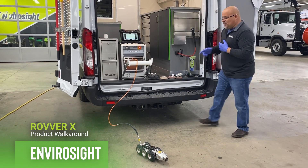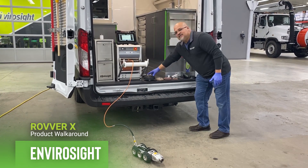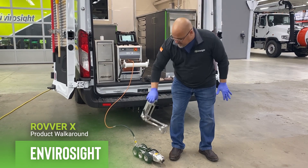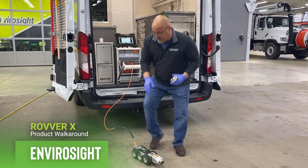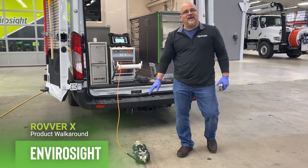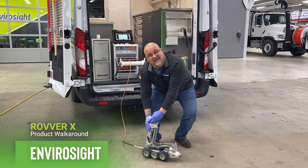I've laid out a few accessories. The machine here is the medium-sized crawler — we're going to do from six to 36 inch pipe with the same crawler. How? By adding some bigger wheels and some accessorizing. We're going to have a remote lift system so we're able to raise and lower the camera for bigger pipes. I also talked about how we drive backwards — well, we need to see what we're doing, so there's the back-eye camera. When we get in bigger pipe, there's a good chance that back-eye camera is going to be underwater, so we added a second one mounted higher up.